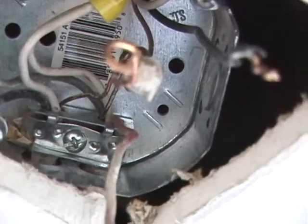if you look really closely, you can see that it's old wire. It doesn't have the yellow casing on it. Additionally, it's number 14 wire. It's not number 12, like what appears over in the other side of the room. So, somehow we have a wire that is supposedly connected at both ends. When the 2 ends are removed, are disconnected, they both remain hot. So obviously there's another hot wire.